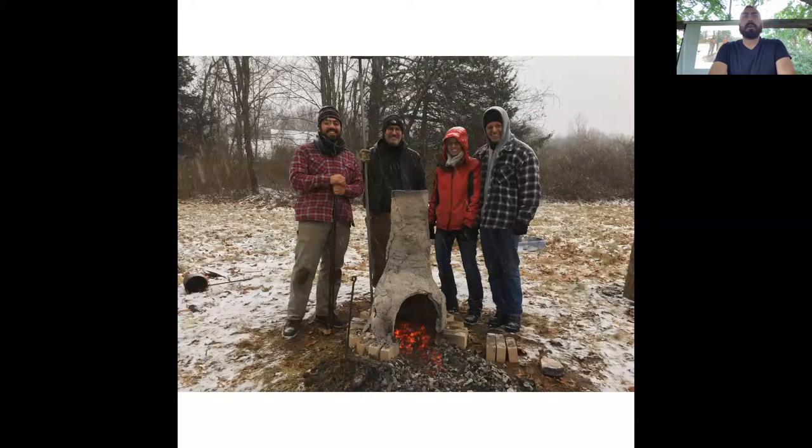You get it up to heat, and then you start timing the drops in the furnace. This is like a living, breathing thing. With the air coming in, the charcoal settles at a very specific rate. And you adjust and fine tune the air until the rate is right. And then you start feeding all the sand in.